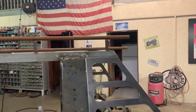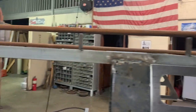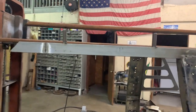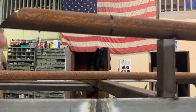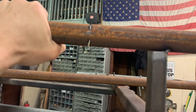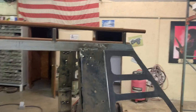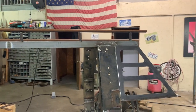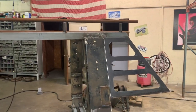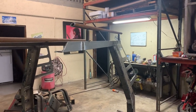Still don't know if I'm going to leave that long or just angle it up, but everything is just lightly tacked into place for now. Once this is a little tighter and welded in, tap this down and make that parallel. It's a nice four-inch gap - surprisingly perfect. I thought I was going to have to shim it, but it's four inches on the nose, which gives it some visual thickness.